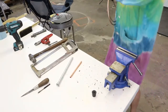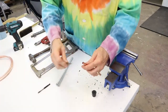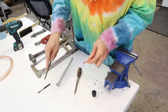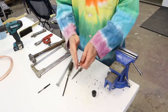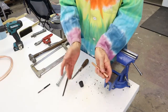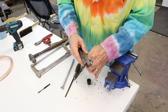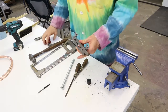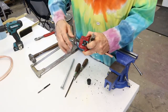The downside to cutting with a hacksaw is that it leaves a rough, ratty end. So I've got a pocket knife to clean up the inside and a file to clean up the rough edges on the outside. We're going to put a flare on one end — we want it to flare out when we put it through the rubber cork, belled out like that shape. For that you're going to need a flaring tool. You can buy these at an auto parts store or hardware store. You put the driver in — it has a cone shape that makes the end of the copper tubing flare out.